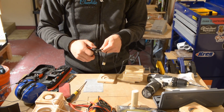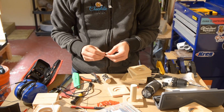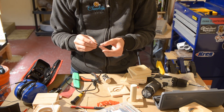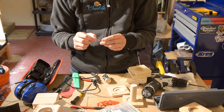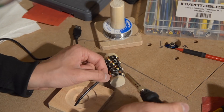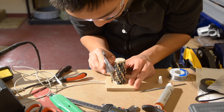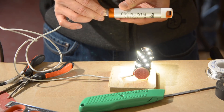To run power, I'd repurpose some old USB cables. This way, I could use a power bank or an existing wall adapter to run my lights — hashtag recycling. I sliced the plugs off the mobile device side of these cables and isolated the positive and negative wires. I drilled a hole through the sides of my oak bases, slightly larger in diameter than my cables, so I could use some heat shrink as a form of improvised strain relief. Inside, I soldered my positive and negative wires to the LED strip. And to keep my power cables from pulling out, I globbed on some glue on the inside where they exited the wood. Before the final glue-up, I made sure everything still worked, then I affixed the base to the rest of the enclosure.